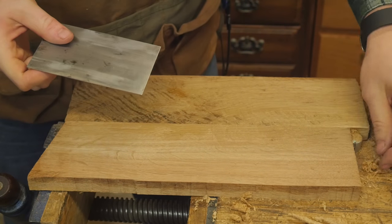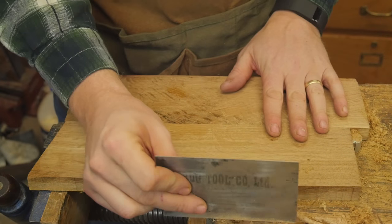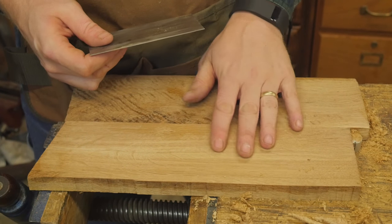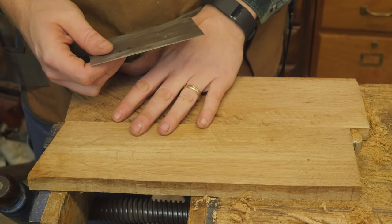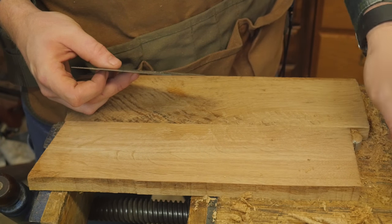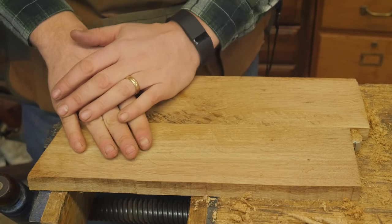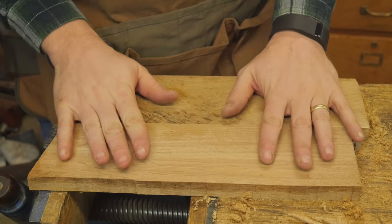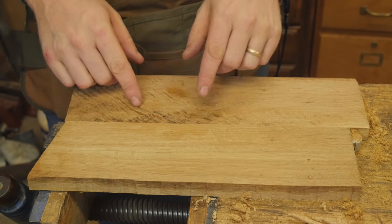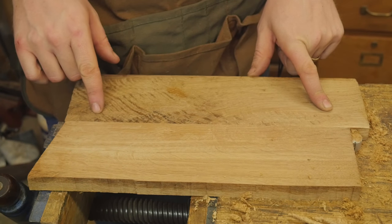You get these fine little curls that slowly take it down. The problem with a card scraper is that it leaves the surface slightly fuzzy. It's never quite smooth, and I always have that feeling that I need to come back and sand it. Also, it leaves a lot of little dust beside the curls, and I don't want to get dust into the surface. I could come at this and sand it all down and get it down perfectly with sanding, but then I'd be forcing dust into all of the pores, cracks, and crevices,